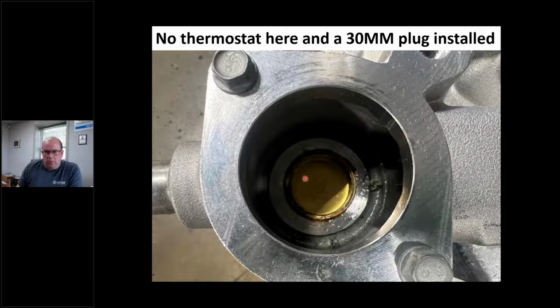Here's the other thing. Where the thermostat will go in a Chevy truck, right? They have a 30 millimeter brass freeze plug drove in here, okay? Because they don't put the thermostat here. They reroute this thing, all right? And that's what's different. If I bolt that car water pump, tear down guy rips this, throws it in a box, right? Or the marina or the engine installer, right? He calls up wherever and he gets that price on that water pump that's almost $500. Everybody's an expert, right? They're gonna look at that and say, that's the same thing. Look up a 2003 Chevy Silverado 1500 and order it, right? And you put that on there and they wonder why it overheats or I'm losing antifreeze, right? They're gonna call you up and go, hey, your engine, I put 4 gallons of antifreeze and it's going right out the back door. What's going on? Or why is this thing overheating, right?